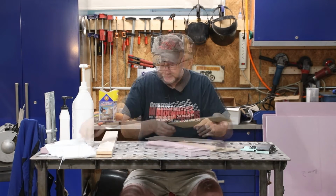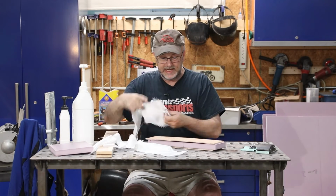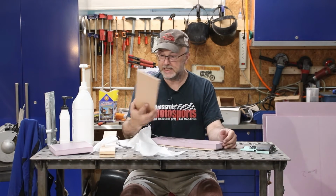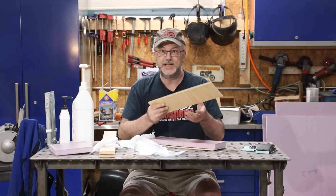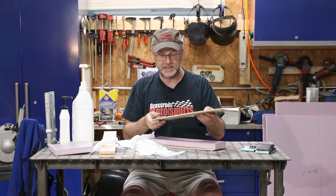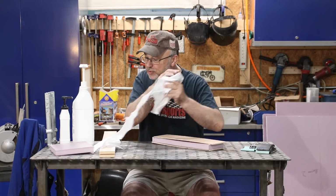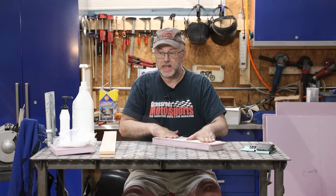I'm going to be using fiberglass, so there'll be 10-ounce fiberglass cloths, coated with resin, of course, to make it more durable on the outside and obviously waterproof, because this is normal interior plywood. It's not marine grade, expensive stuff or anything like that, so it does need to be protected. On the inside, where I don't need quite as much strength, I'm using a lighter 4-ounce fiberglass.